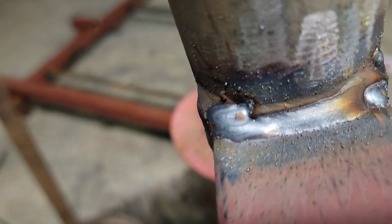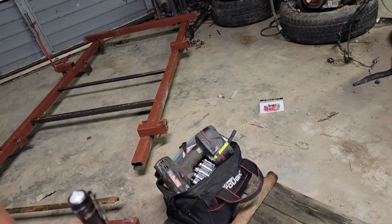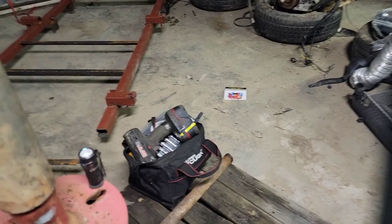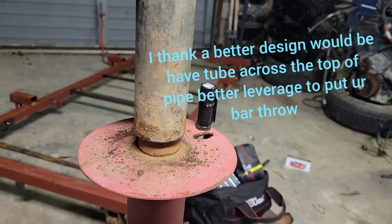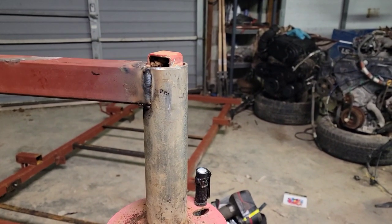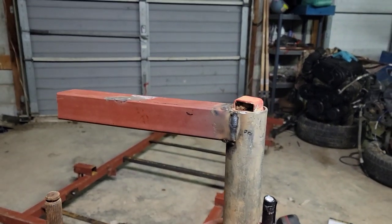Looks like I might have a little bug hole there. I welded a bug hole up there where it blowed through. Still got a lot of tubing left. I've seen people leave it higher and put a bolt and nut through it, but I don't think it's coming off. If I think it's going to cause problems, I'll weld a washer on it, or maybe even a small bearing for it to sit on. Seen a lot of people put bearings in these, but I don't have any. I wanted to do this without spending any money — just build it out of scrap.